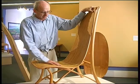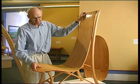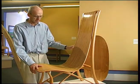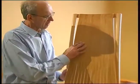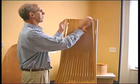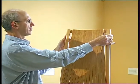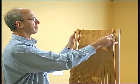The chair can flex. The heavier you are, obviously, the more it flexes. This one is finished with a lacquer finish. The previous one you saw was just raw wood. As one can see, these laminated strips go up in a joint, and you have a curve here, basically a compound curve to accommodate natural form. Quite tricky, they're then glued on up at the top here. This top member is joined to the top of the legs with what is known as a bridle joint. In fact, it is not a cabinet making joint, it is a carpenter's joint, but is highly effective in use in this instance.